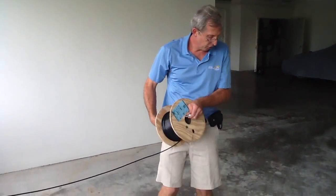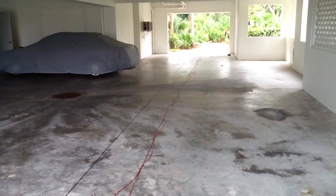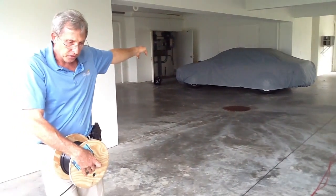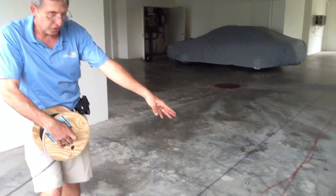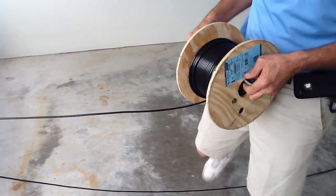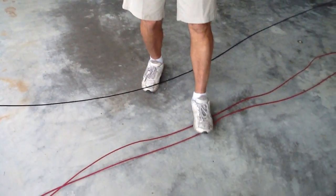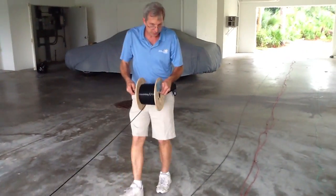Look here folks — see these two red conductors laying out here? We pulled those out of that meter room over here to my left. We already pulled a ground wire here; this is a number 10 ground, for you electricians and homeowners that need to know what's going on. I'm pulling another conductor out now. We've already pulled one — this black one here — and we used these as a measurement because we didn't have a ribbon to measure things.